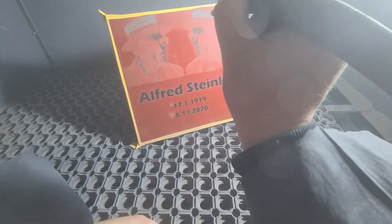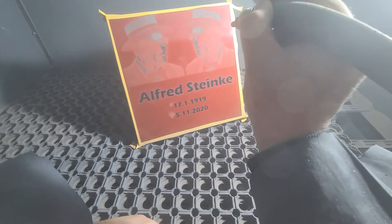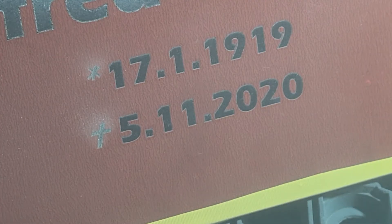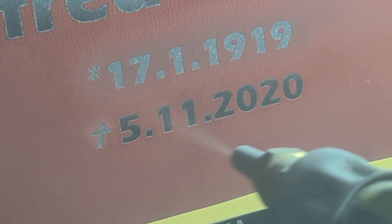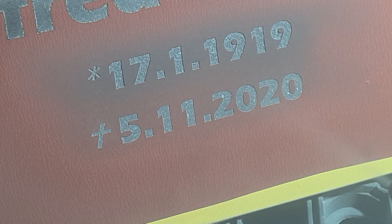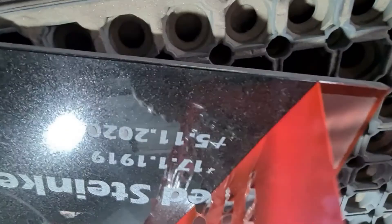We take a little more distance when sandblasting portraits. When we go down to the lettering areas, we can go a little bit closer to go faster and deeper into the material. Even though the laser mask film is just 100 microns thick, it's really tough. You can go very deep with 150 mesh. If you want to use a 40, 60, 80, or 100 grit mesh, you can coat the laser mask two, three, or four times for a thicker tape on your stone, allowing you to go even deeper.